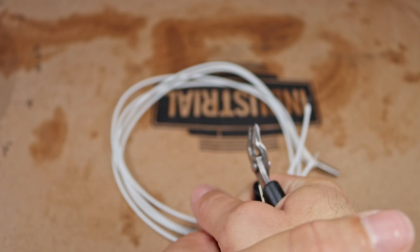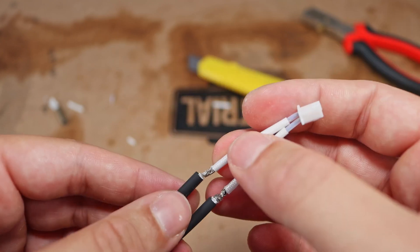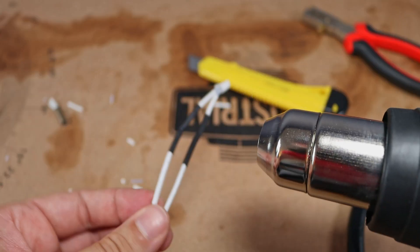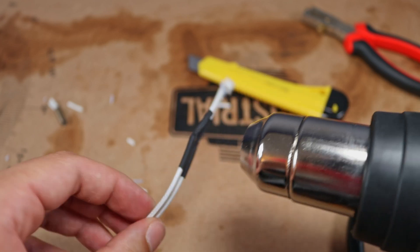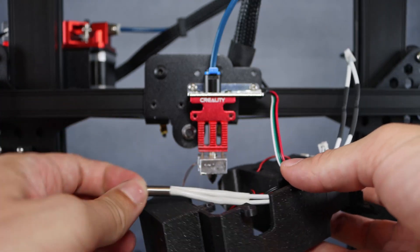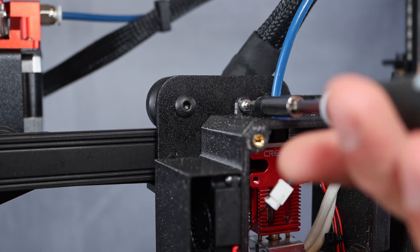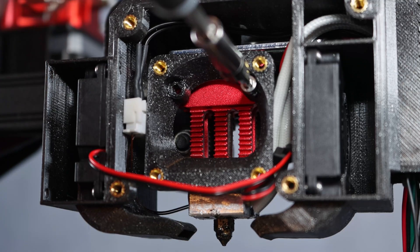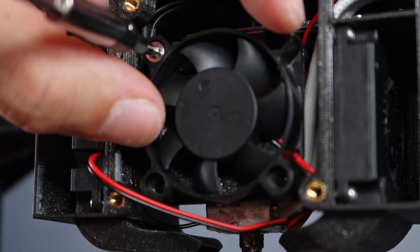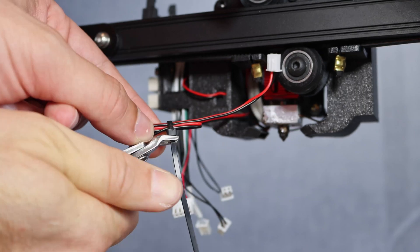In order to withstand the current, I'm combining the old connector with a 40-watt heating cartridge that comes with a longer cable. After connecting the two parts, I'm using some heat shrink tubing to make it a tight connection. Fumbling the heating cartridge through the housing before reinserting it into the heating block, and finally screwing on the hotend cover onto the hotend carriage. Don't forget the 40mm fan duct for the heatsink cooling — installing the 4010 axial fan.